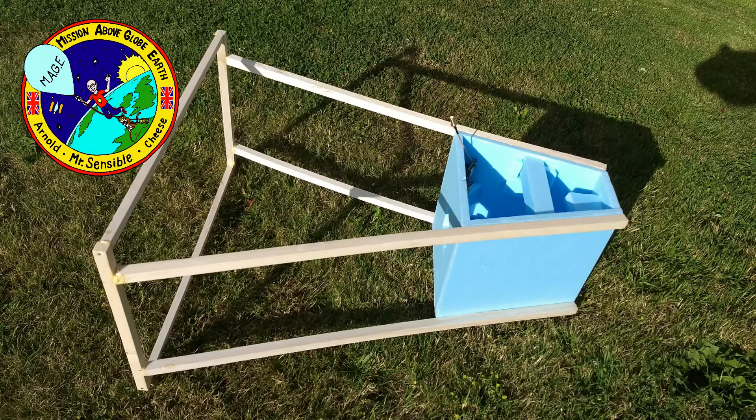Now we've made a number of changes to Mage: we've added a third camera and therefore a third battery pack; we've added a second tracker unit; we've added a GPS antenna; and we've also added more woodwork to enable the reference frame strings to be taut. It presents a new problem: too much weight. The balloon chosen, the amount of gas required, and the size of parachute needed were all based on a payload weight of around 500 grams.